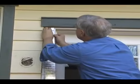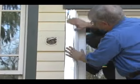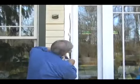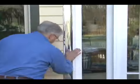You can see how that's going to work, because if any water were to ever get behind the trim, there's no way it would get between the actual sheathing, the rough framing, and the door. It completely weather seals this opening in case any driving rain gets behind that trim. Let's go inside and I'll show you how to put the fiberglass insulation on the inside of the door.